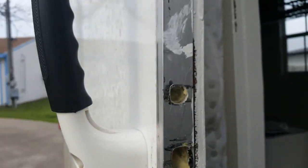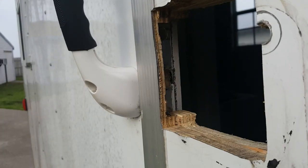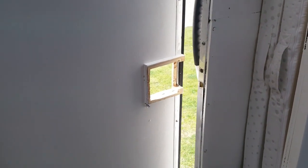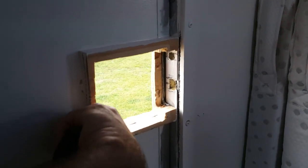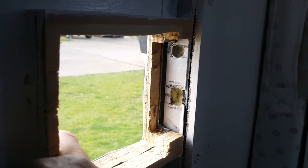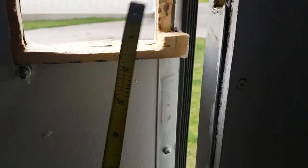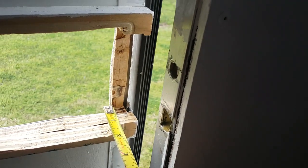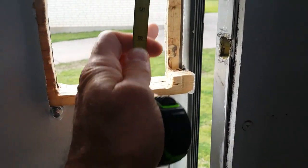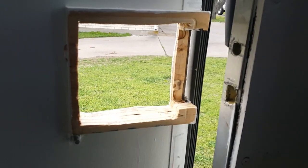You can see the holes I had to drill for the deadbolt and for the latch, and the original wall there. From the inside, when I pull it shut you can see the assembly engaging those two holes cut in the original wall — it kind of recesses in there. That routed-out part is about seven-sixteenths of an inch deep, four inches tall, and it's close to evenly divided top to bottom.